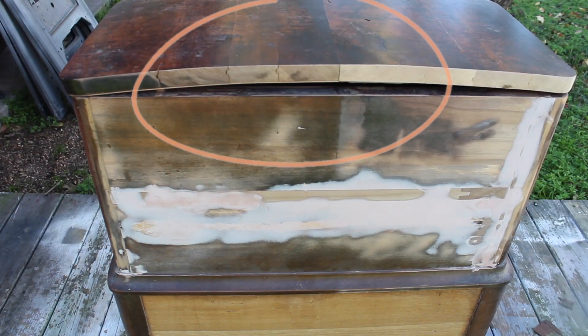Now that those pieces are cut, I ended up sanding the edges to round them to match the other corner. I traced it by overlapping one on top of the other so the rounded corner would coincide with the square corner, traced it, cut the excess corner off, and sanded it smooth. Once it was smooth it was time to glue, but then I realized it was extremely bowed — another obstacle. To fix that we're going to screw it from the top, then Bondo and sand those screw holes to cover them.